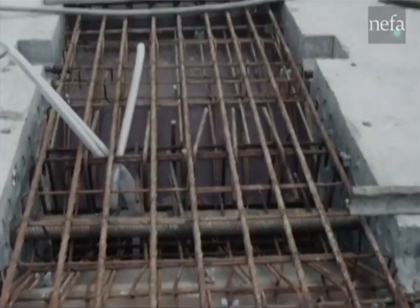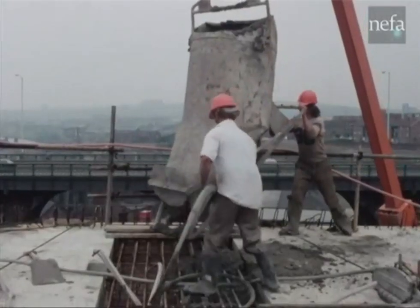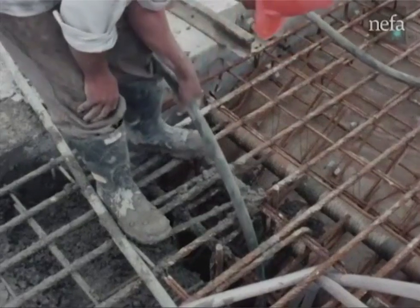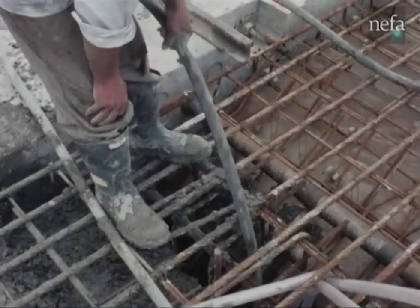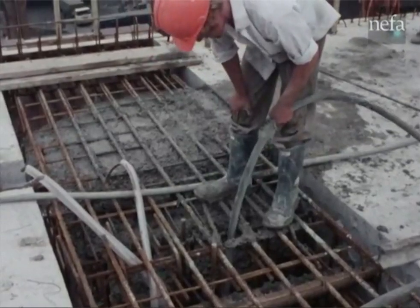The careful control has brought the cantilever ends accurately to their meeting positions to produce a smooth alignment. Considering the problems, foreseen and unforeseen, of casting and erection — the deflections, the creep and shrinkages and other variables — this is a triumph for the intense engineering effort put in by the contractors, John Mowlem, and the consulting engineers, Ove Arup and Partners.